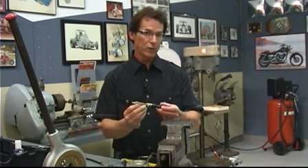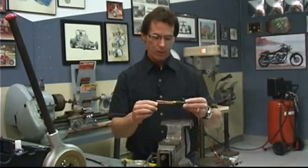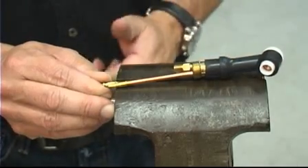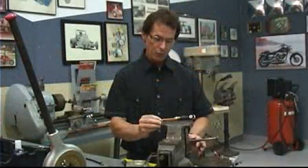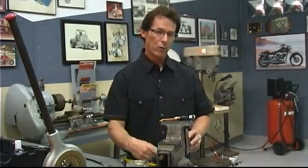It comes with stainless steel wire ties to install the water and gas hoses — four included, but you only need two. I'm going to mount the torch in the vise, right behind the brass fitting. Be careful not to over tighten it, because these are dead soft copper tubes and they will pinch and could restrict the water flow on your torch.